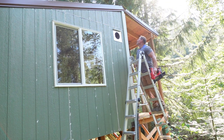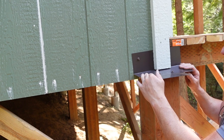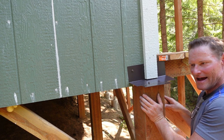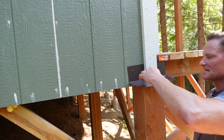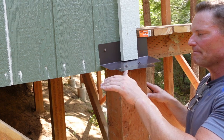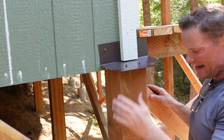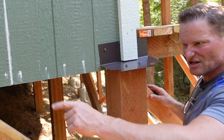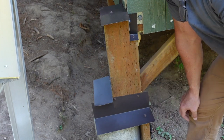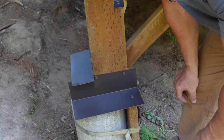Hardest corner done. Before I got the trim in, I found this brown galvanized steel flashing because this post extended past the cabin — as you saw on the foundation layout, we measured a little outside the box. The six-by-six pressure treated post would soak all the rainwater straight down, so I put a metal cap over the top and L-flashing up under the siding to direct water away. That increases the longevity of that post. It's a little hokey-looking but it'll keep it from rotting and soaking moisture down into it.